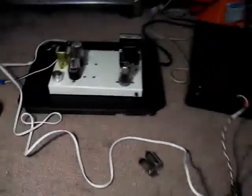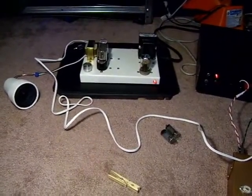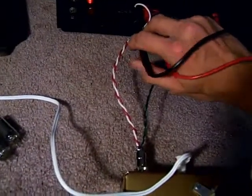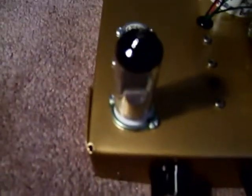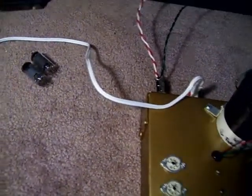Now let's fire her up. I'm going to turn on the heater supplies for the radio, and turn on the audio amp and let it sit for a second so the filaments can warm up. Right here I have my multimeter — I can show that the heater supply maintains very, very close to 6.3 volts. The cathode should be warming up shortly, then I can turn on the B+. Immediately you see that the tube begins to glow. I'm going to adjust my B-plus supply for about 196 right now — put it at about 201. That works.